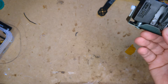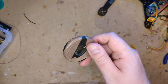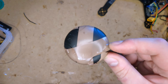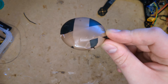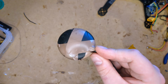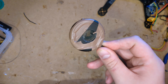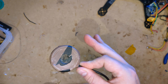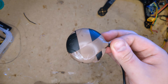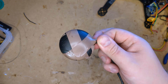Hopefully that'll be dealt with by the next thing on the list — this, which is a GPS antenna. And this allows the drone to operate completely autonomously. Because it's got GPS, you can just put it somewhere in the sky and it will stay there. Or you can do the most crucial thing, which is return to home — it saves what position it was in when it first took off, and then if you activate return to home, it will fly back to that position and safely land. You can either activate it manually if you lose video feed, or if it drifts out of range, it will automatically go into return to home mode.